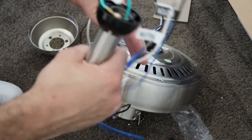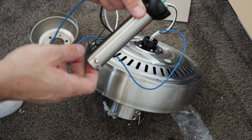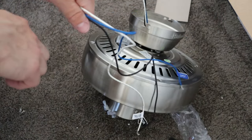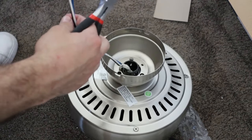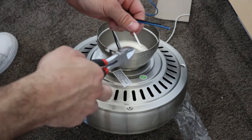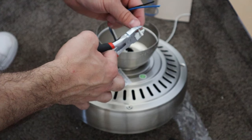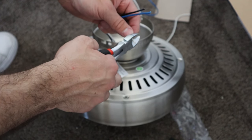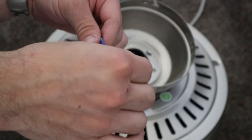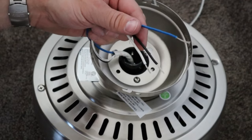Looking at our fan base here, we've got quite a bit of extra wire and I am going to cut some of that off. But I'm going to make sure that I leave enough so that if I ever did decide to drop it down from the ceiling a little bit, I have enough wire to do so, even though I'm pretty sure this is going to stay a flush mount. I'm going to take my wire cutter and remove a lot of this excess wire — I don't want to remove too much; I want to make sure I still have some wiggle room when I go to connect everything. Then I want to remove the ends so that I have some of the actual wire exposed, cutting through the casing by just pinching a little bit on the outside, enough to break through without cutting all the way through the wire, so I end up with exposed ends.